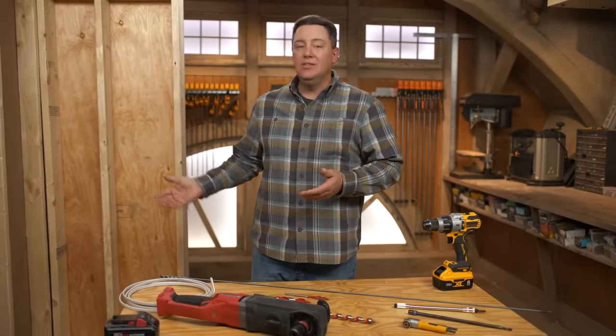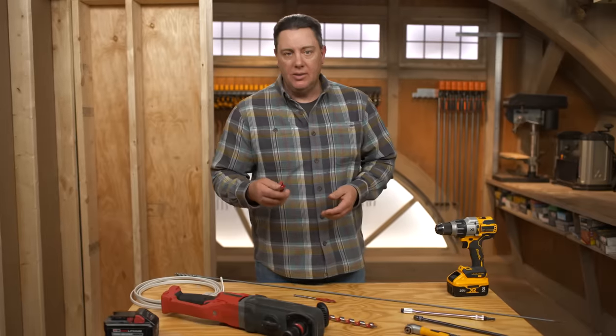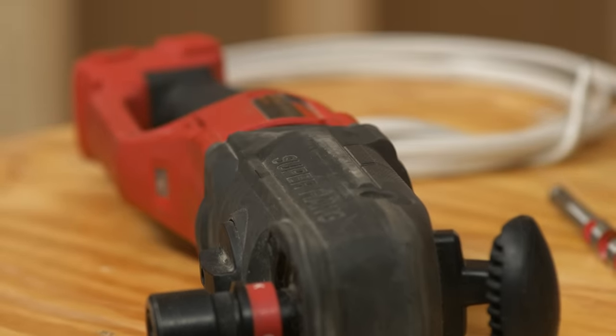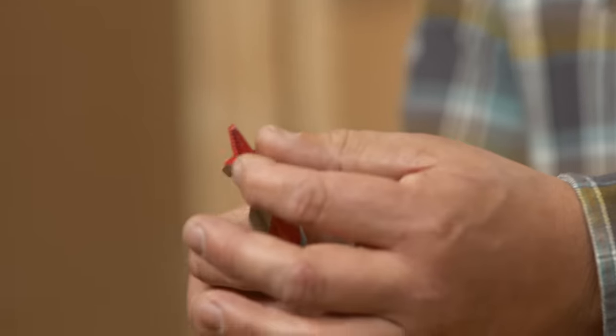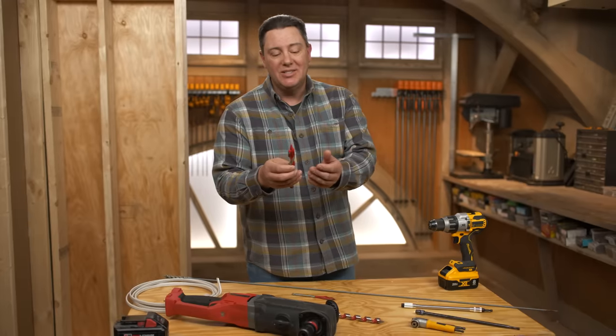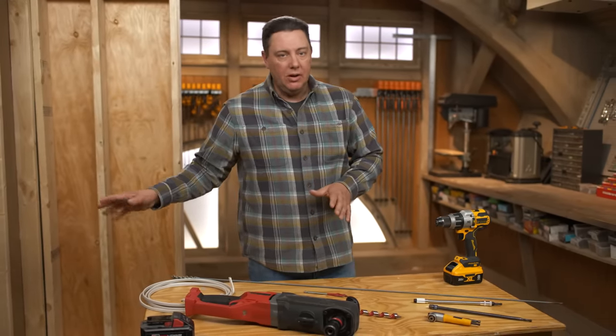When it comes to drilling holes in a new home or an addition where you have wood studs, there are typically two types of drill bits I'm going to use. One is the auger bit, which goes into a drill that's meant to drill a lot more holes. The advantage is it has a self-feeding bit on top, stays sharper longer, is meant to hit a couple of nails you'll probably encounter in some studs, and just makes the holes much easier and lasts much longer.